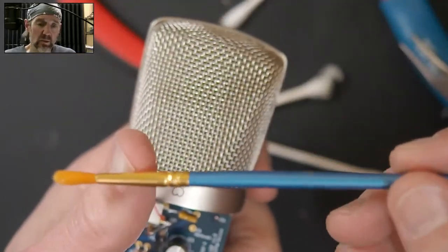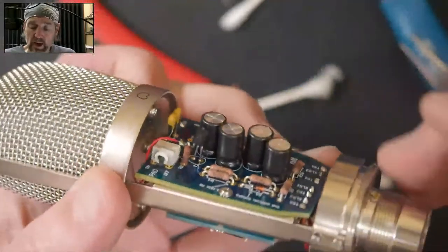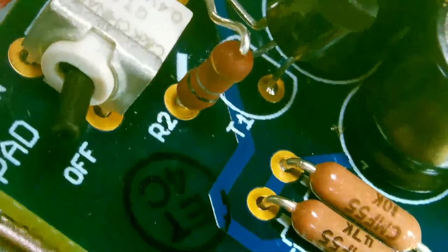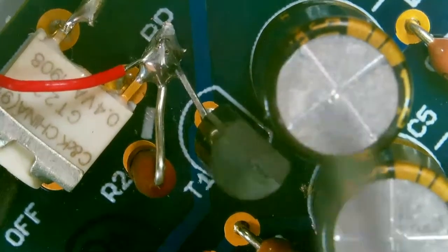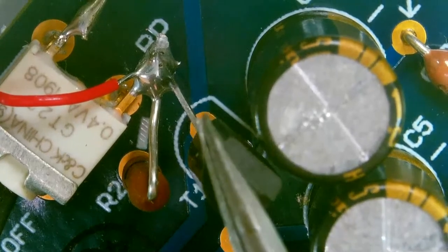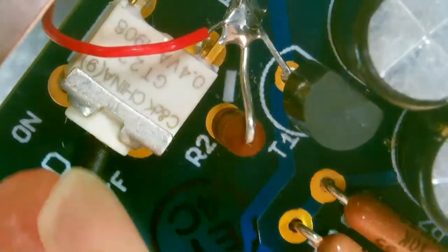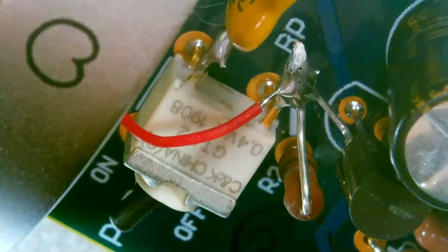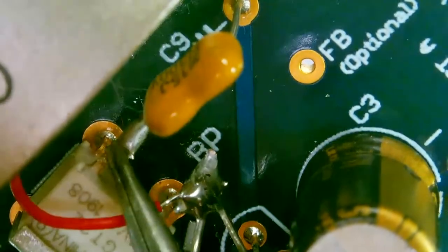So what I do is get these inexpensive paint brushes. Where we're going to apply it is the high impedance joint — basically everything that's connected to this one-gigaohm resistor. Let's jump over here for a closer look. That's the one-gigaohm resistor R2, connected to switch pin four. Also connected to switch pin four is this red wire and the JFET gate — JFET pin three. That's it when the pad is off. But when we switch the pad on, the switch shorts pin four to pin six internally. Pin five is not used.